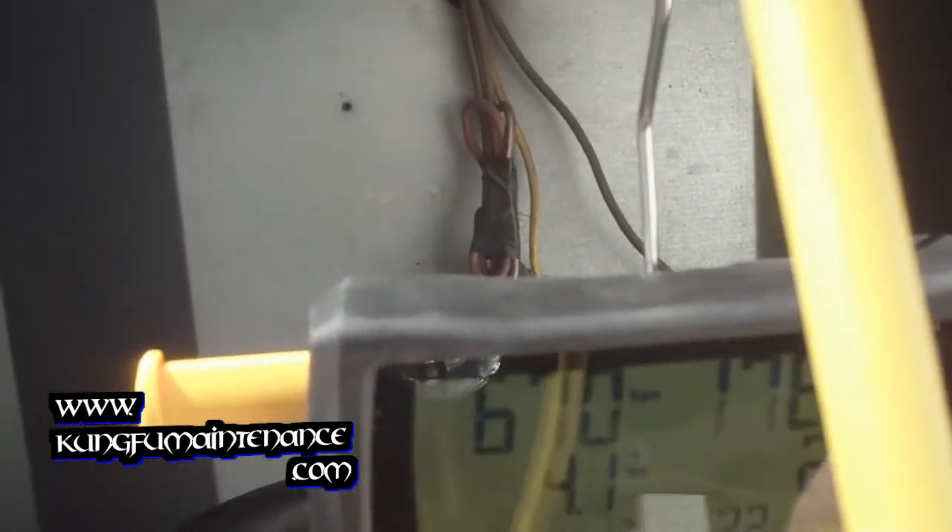So we're showing our indoor wet bulb. I haven't taken an outdoor dry bulb temperature, but I know it's about 108 degrees — I'm like the living thermometer out here, it's hot. Cycling through — now we're at 10.1 superheat, dropping a little bit there and adjusting. Really we're looking for 8 to 15 degrees superheat. Not the same on subcool, so we've got a ways to go. Although my low side line is feeling nice and chilly — that's a good sign. I've got some ice on the compressor here to help it charge faster and get things going sooner.